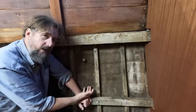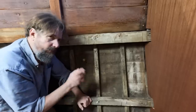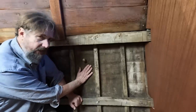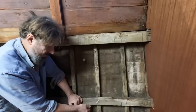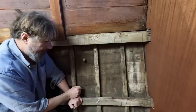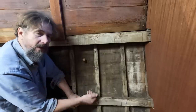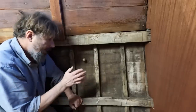It makes the inside of the hull clean in situations where the inside of the hull is going to be exposed. More on that in a little bit. But the other thing it does is it promotes better ventilation. This is the outside hull, and it's always going to be a little bit damp, especially as you approach the waterline. The waterline of this boat is just above the sole. So you've got to get good ventilation through there. Traditionally, ceiling would leave an inch or so gap at the top, and natural convection ventilation would come up and out, and it would ventilate reasonably well.